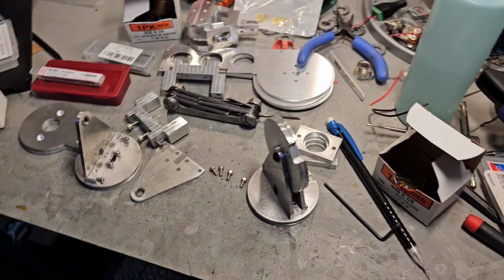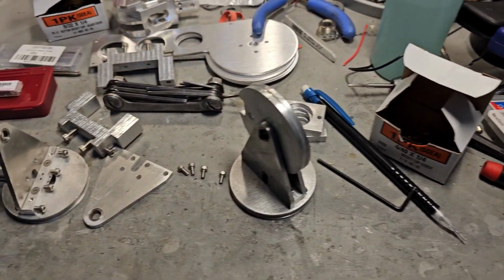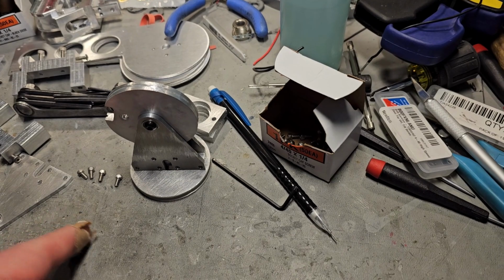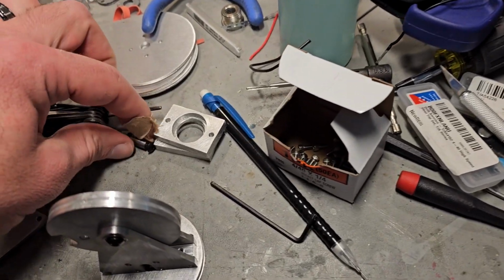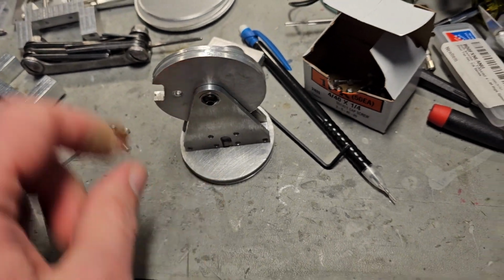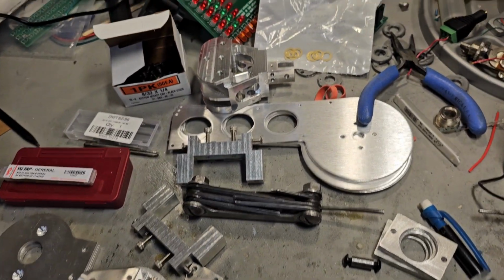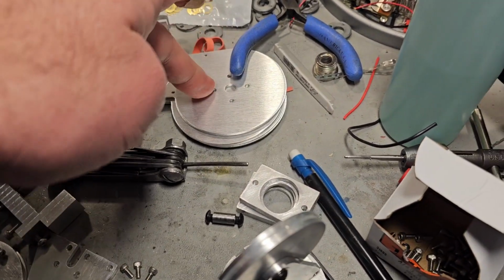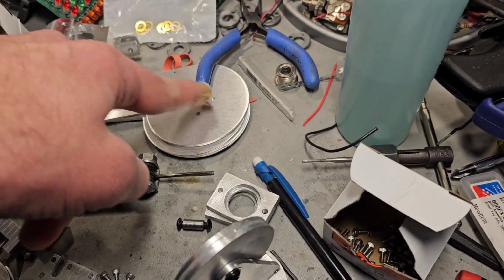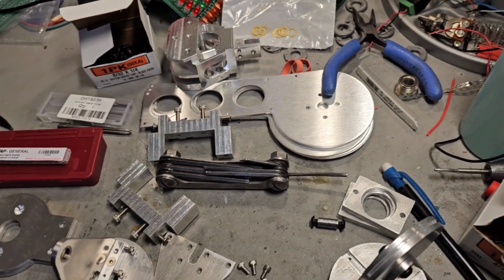So as you can see here, we've got some wrist components that have been going together. So I've been working on that. Went and had to make some of these little pieces here on the lathe, and get all the screws and the bits to put all this together. There's some of the other wrist components, the lower arm. So I'm planning on tonight doing some countersinking on that, in preparation of assembling that together.